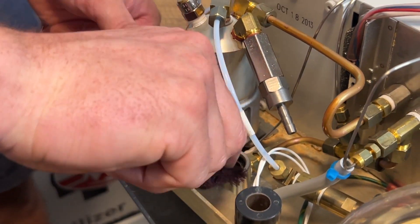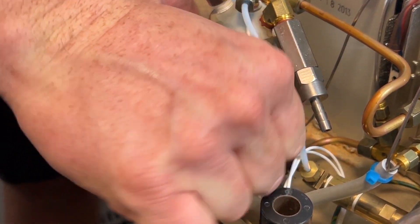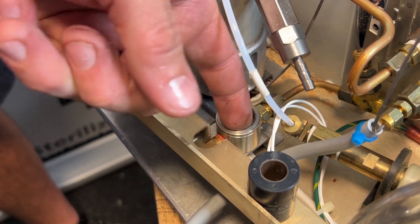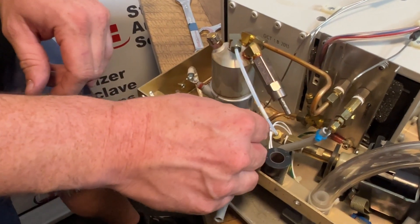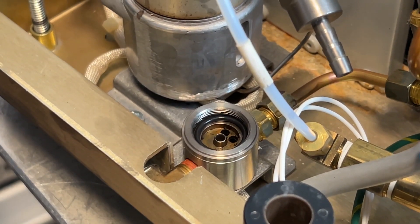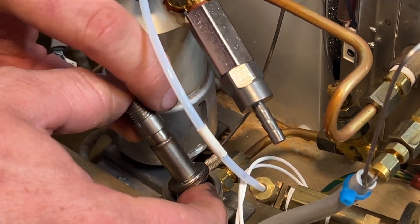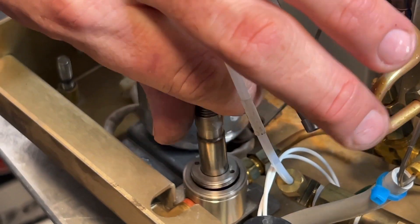I'm going to take the same Scotch-Brite and maneuver it around on the inside. If this one was going back into service right away, I would be cleaning this a lot better and using a vacuum to actually pull all that debris out. I am going to replace this O-ring — it will slide right down in. We are going to take the plunger, holding it with the plunger covered by my finger, roll it upside down and just drop it into place. You do not want to lose that spring or that plunger.